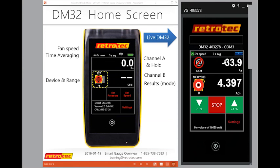So now while that's happening, if I overshoot or undershoot, I can tweak the fan instead of tweaking the speed control knob. The reason this can be very helpful is that I can now walk through the house, if this is a Wi-Fi unit, and use remote devices, my phone or a tablet, to tweak it back down if I really need to stay close to that. So I can increase slightly up. Notice I went from 20 to 21. You've got to give it a few minutes to find its balance. All right, maybe we'll go 22.